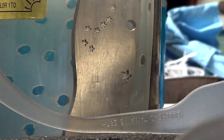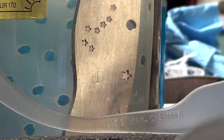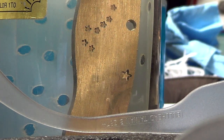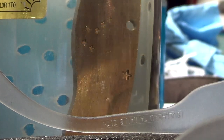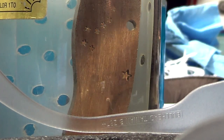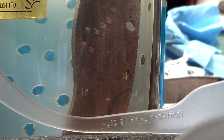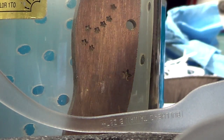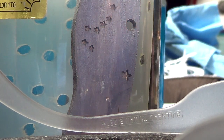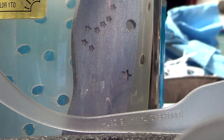And then we'll slowly go up the voltage here. Or should we ramp it up? It's always more fun to ramp it up. Whatever, I'll just ease it up. Let's see, there's 10 volts. Yeah, it's going bronze now. See how it's just starting to bubble? It's 20 volts, should be purple once it works. Let's go up to blue. Gold is right around, Eric told me 65, that's his magic number.